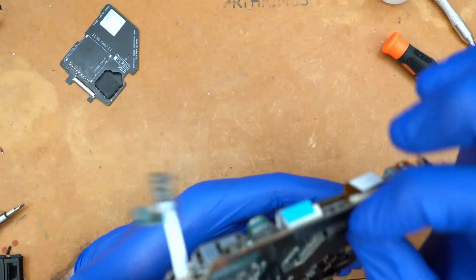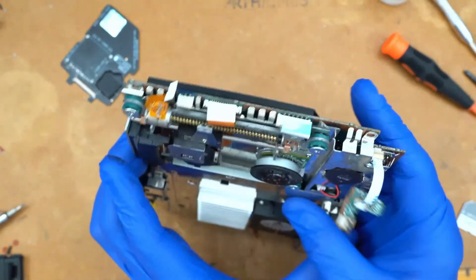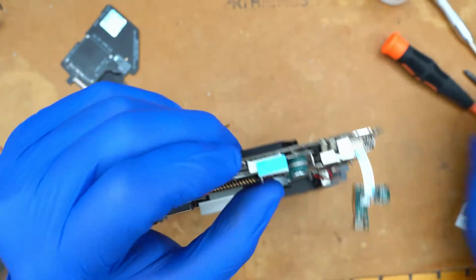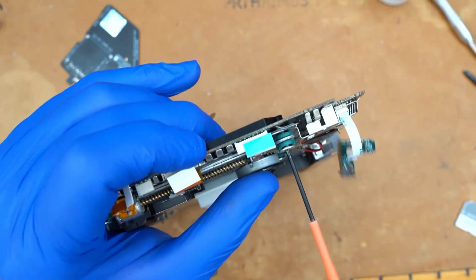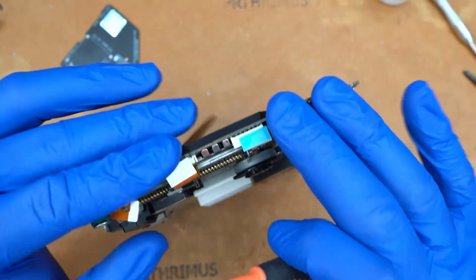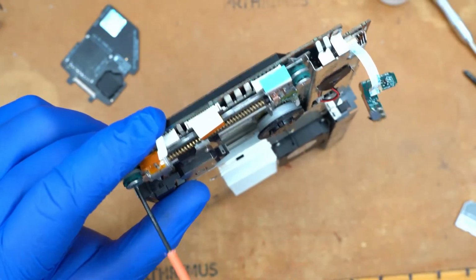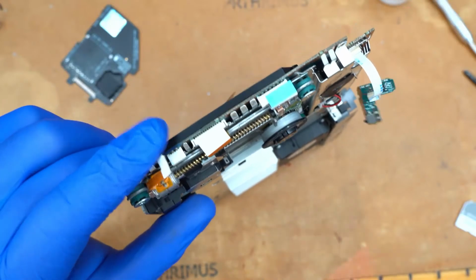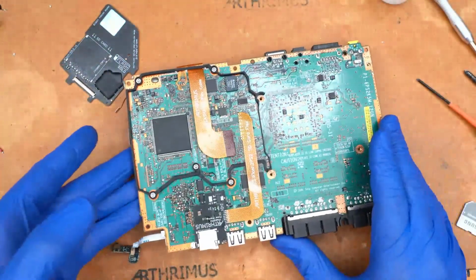Eric, I don't know what to tell you on that, to be honest with you. If the reset works on the N64 mod, then 15-bit color and de-blur should work. Oh, if you're using a standard AV cable, you won't be able to see that. The de-blur and the 15-bit color are only for the RGB signals. You have to have an RGB cable to even see them.